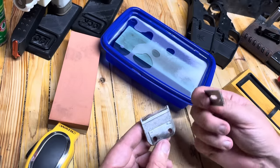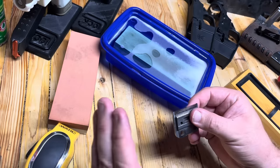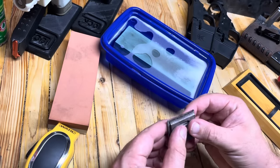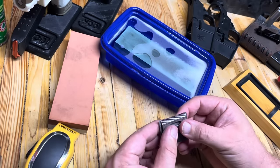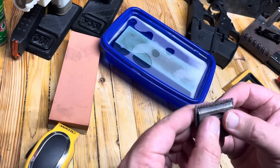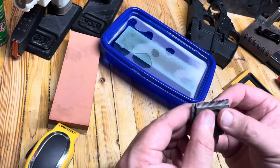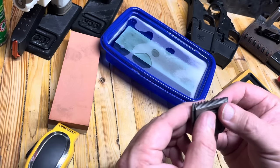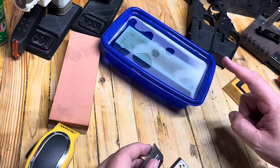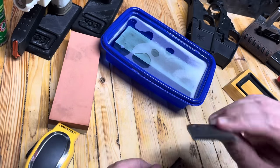We want to make sure that everything is flat, and I'll show you how to do that. This process is called lapping. Pretty much anyone can do it — there's nothing special to it, don't be intimidated. At the end, I'm going to show you about something they call setup, which is how you have your blades set up and how they interact with each other, because there are some things you need to pay attention to there. Once we get this sharpened up, our stone is almost ready, so let's begin.